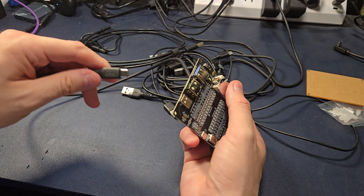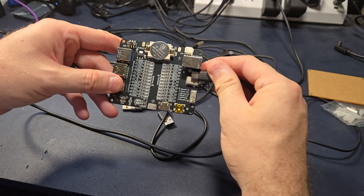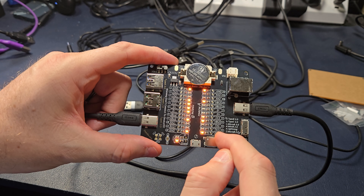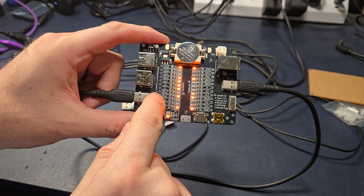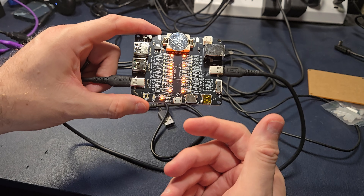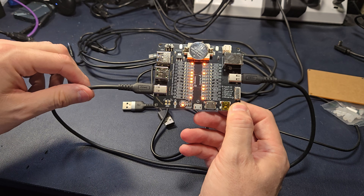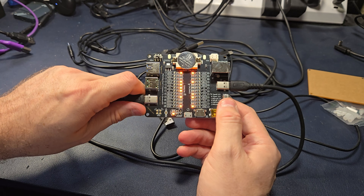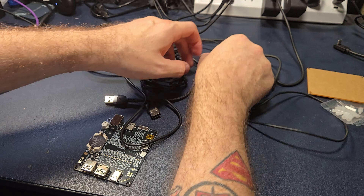What we have here is a double-ended USB-C cable. We're going to plug C to C and see what we got. We definitely have ground and the bus cables, and we also have data transfer. We do not have TX here. So this probably has very basic data capabilities — no high speed data. It does have CC2, which is some sort of a configuration thing. I have a feeling that has to do with negotiation of high drain devices or high power connectivity — leave it in the comments if you know. I'm pretty sure CC2 means it can negotiate more PD, probably higher speed. I know this came from a 100-watt brick, so it's probably a high power transfer cable.